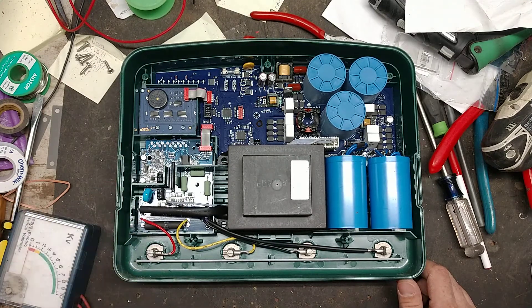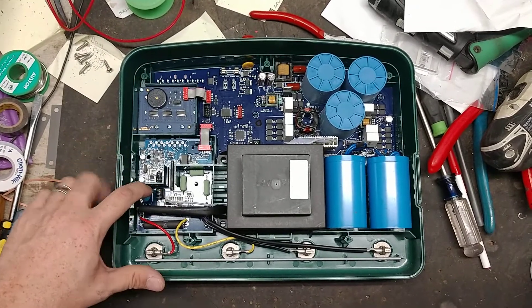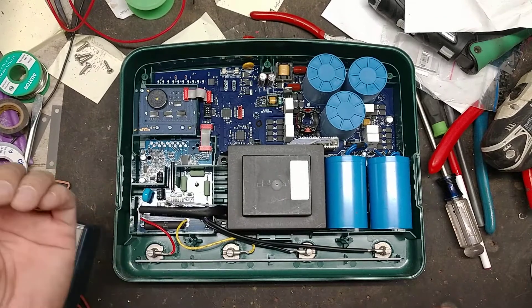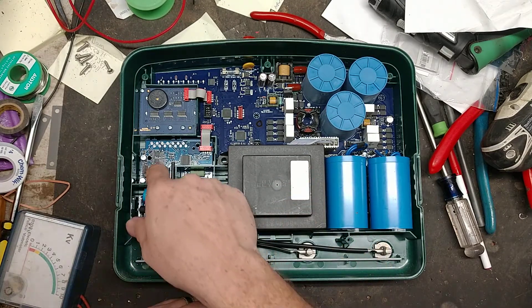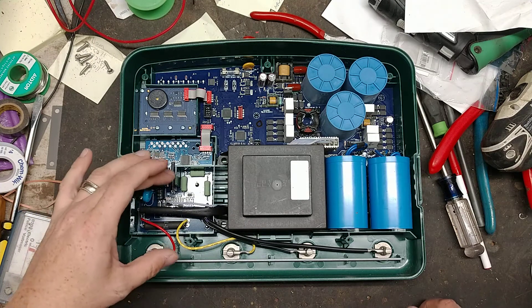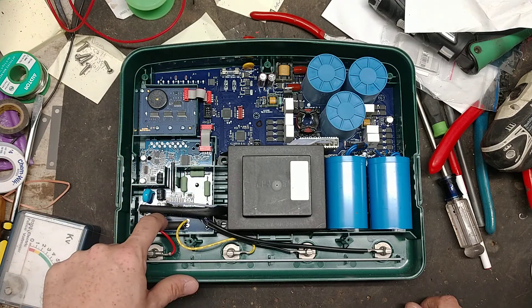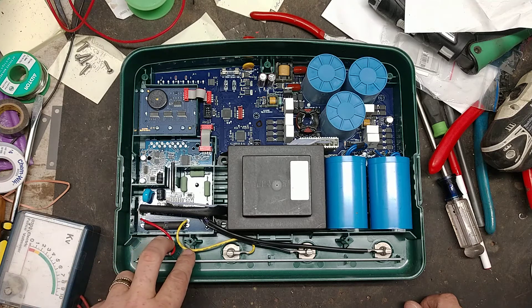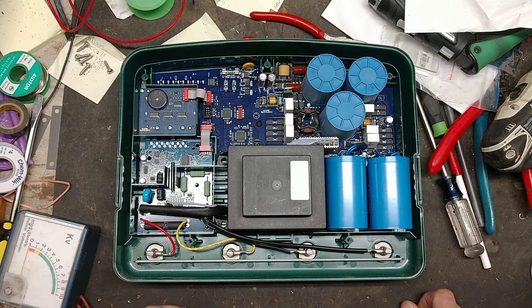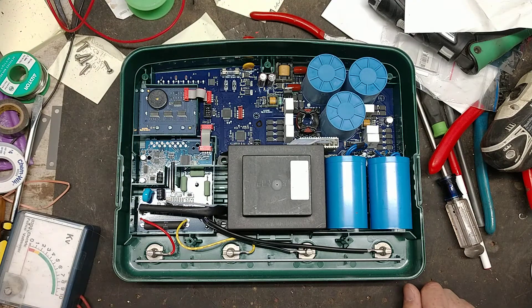This board here is your output or logic board — there's a lot going on with it. This little blue device is your lightning protection piece; they've also got a little lightning rod right here. This little black device is part of the remote control — it's an inductor that picks up the signal from your remote control; actually there are two of them on there. This big resistor is what brings the power down from full power to half power for the yellow terminal on the front. There are a lot of software chips — this thing is like a miniature computer.